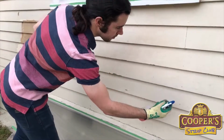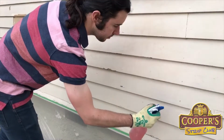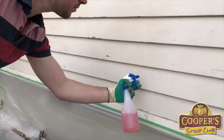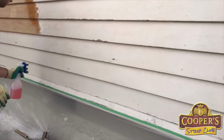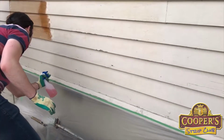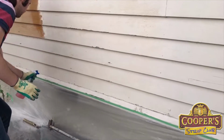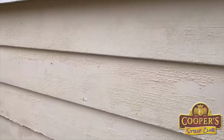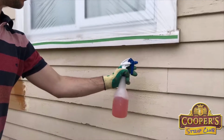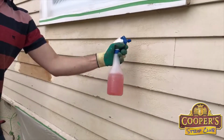So this first layer of paint is acrylic, which we find goes quite rubbery. And we'll find that it will absorb the stripper very, very quickly. Now, stripper being thin, you'll see that it absorbs very quickly. If you move to the top there, you can just keep on. So being thin, once it absorbs in, it will generally need another coat to back it up. You'll see that it's thirsty there.